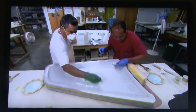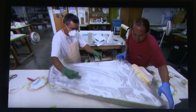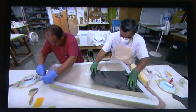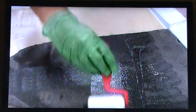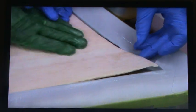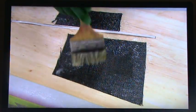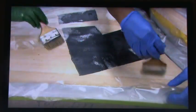When the paint dries, they roll epoxy resin into the mold, then put down a layer of fiberglass. They reinforce the fiberglass with super strong carbon fiber, then brush on more epoxy resin. The next layer is balsa, a lightweight wood from South America. They apply carbon fiber to sections of the wing where parts are to be attached, and another sheet of fiberglass and epoxy is the final layer.